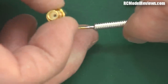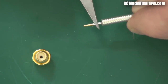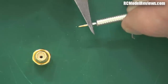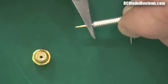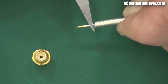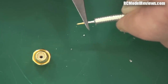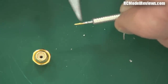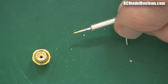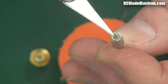I give that a little scrape with my knife — the solder is quite soft so it comes off easily, and it makes for a better job. It's important to check at this stage that none of the solder you scraped off contacts the end of the braid. You can see there's no solder in the area joining the inside to the outside — that's all nice and clear, because you don't want a short circuit on here. That'll ruin your day.